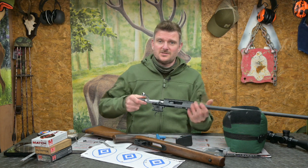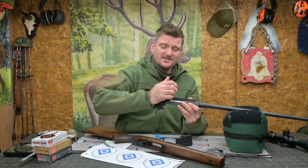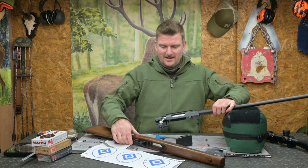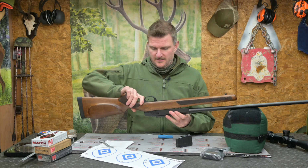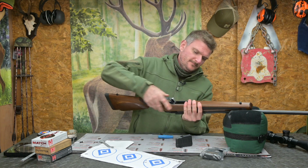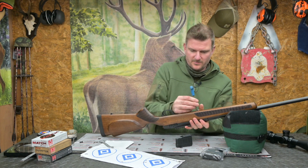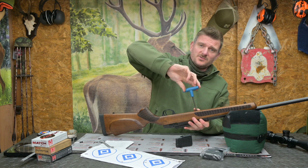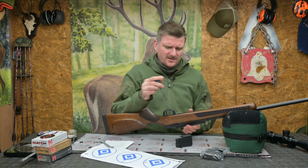Of course the 3 lugs on the bolt lock into abutments on the receiver itself, so you get a really nice fit and finish and feel for this rifle. Right, let me just pop this back together because I'm going to weigh it then. Tension these screws back in place. Again, when you put them back and screw them together, you can feel them just nip up and go solid. You don't feel this bendy springiness in the rifle.